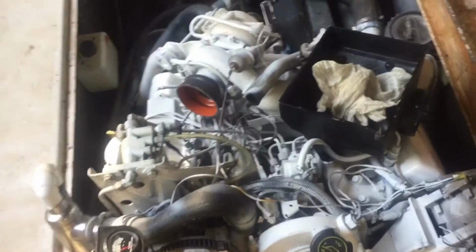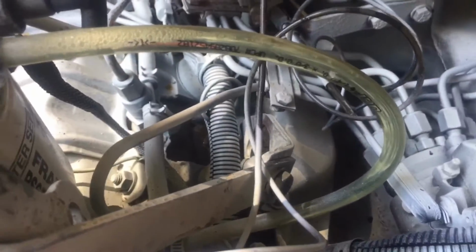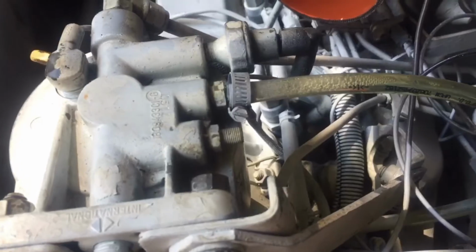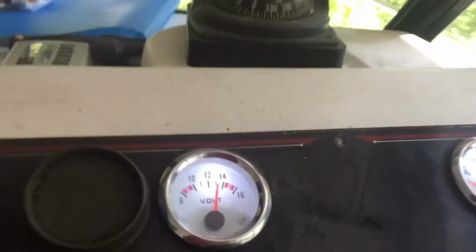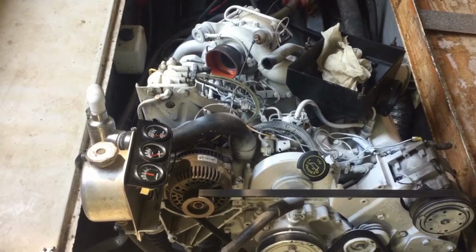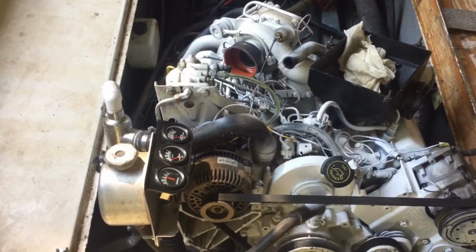So I also forgot I gotta charge the batteries. But you can see here the bubbles, now that I shut the engine off, they're coming back up. They just shoved a bunch of these bubbles down there. So I wasn't even getting that yesterday, because I wasn't able to turn the engine over. But anyway, that's what I'm talking about right there. Okay, it says we got enough amps, or excuse me, volts. So we're gonna charge the glow plugs for 10 seconds. And here we go.